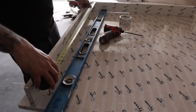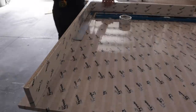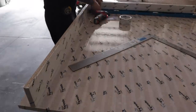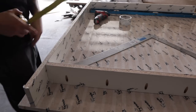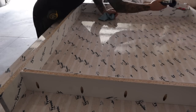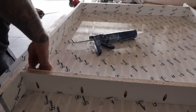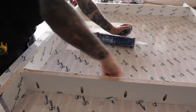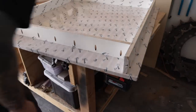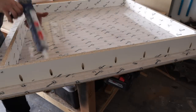I drill out my pocket hole screws all the way across those sidewalls and that gives me a pretty tight, secured bond to the platform. I'll do one on the edges too to keep the vertical support straight, squaring it up, trying to keep everything as close to square as possible. It's not really that big a deal — I'm going to cut everything down to size after the table gets finished. I run a small bead of clear silicone on the inside and on the outside edges, making sure to keep all that epoxy inside the form.